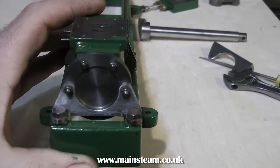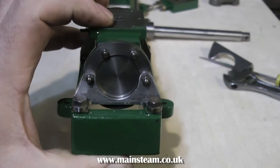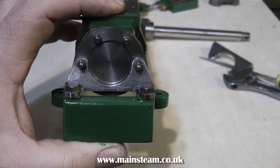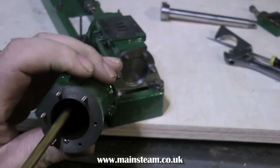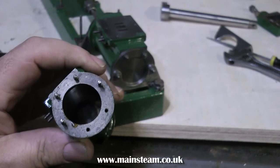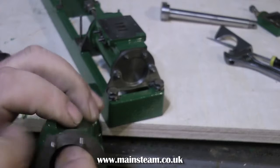When building or replacing a cylinder on a Stuart Victoria, it is really important — in fact it's essential — that the port face is perfectly in line with the base. If the cylinder is canted over in either direction, not only will the engine look bad, everything will be very out of line. So if you are building one from scratch, be very careful at the marking out stage of the cylinder for the bolts that mount onto the angle bracket that you have to machine.